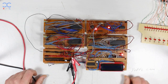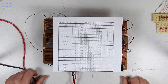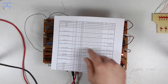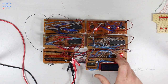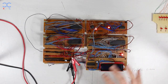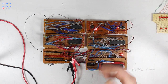Right now you can see it's working — I don't have the buses connected here, I have a panel for it but it's overburdening for this video. It's running a little program that takes a small segment, loads it into the RAM, then calls the RAM and runs the program from it, just to test that everything is working. Some elements like the display and the input/output still have problems I need to solve, but we're going to focus on the transfer process in this video.